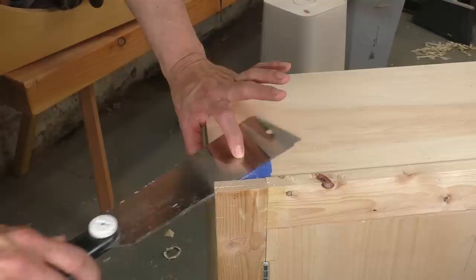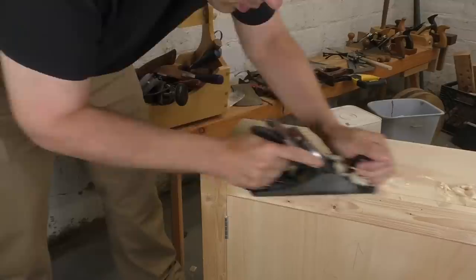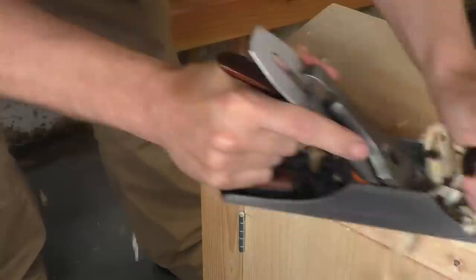But these are still sort of laboratory tests. We need to bring these planes into a more real-world environment. I've been finishing up this kitchen cupboard and now I'm ready to attach the trim, get everything trimmed and straightened, and get it prepped for final finishing. This is the perfect test for these two planes — I'll use them all day long. First thing is to trim this face frame. My handy Ryoba saw handles the flush cut, but the final trimming is all hand plane. The pieces meet at right angles, and the cut is demanding because it transitions from squishy end grain to long side grain. I skew my Bailey plane for a slicing cut and it handles both surfaces just fine. I switch to my bedrock and the results are the same — both surfaces are quickly trimmed.